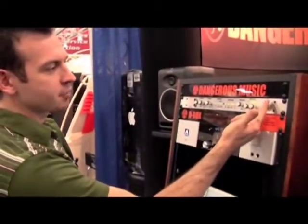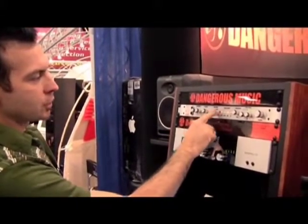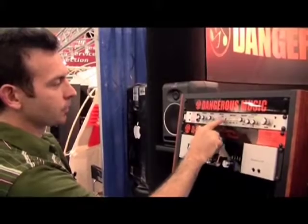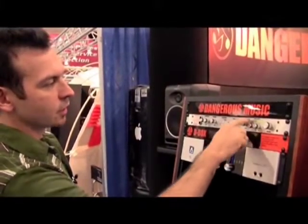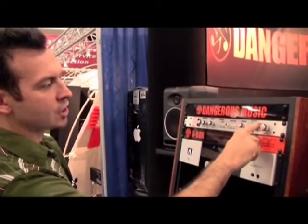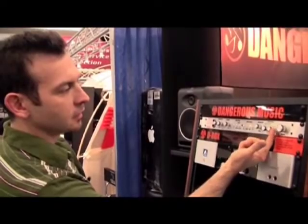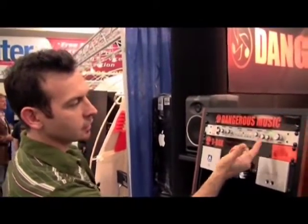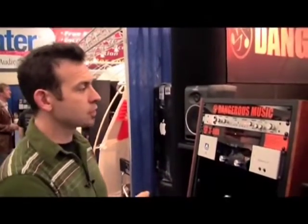On the right-hand side, we have a precise volume control that controls two sets of speakers. We have an analog summing section with an LED for all 8 channels. On channels 7 and 8, you can pan from left to right — therefore you can assign a stereo or mono channel to those two channels.